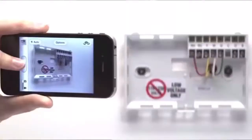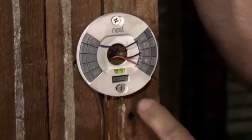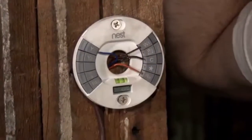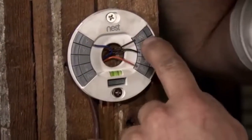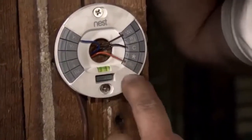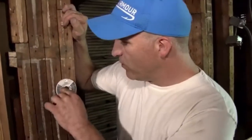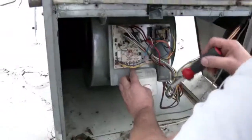The second problem is when the wire colors don't match the picture-perfect wiring diagram on the Nest website. Don't panic — wire colors don't really make a difference. They're all copper conductors, like twins except for the colors, which are only for identification. For instance, blue might be Y1, brown is W1, black is common, and orange is RH. Any of these colors can be used for anything. Just get a pen and paper, write down what color goes to which terminal at the furnace, and make sure they match.